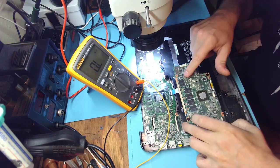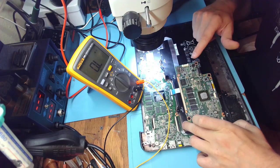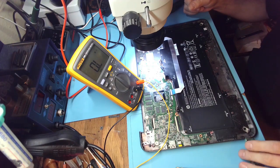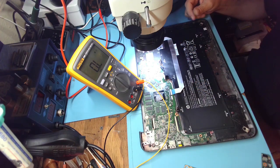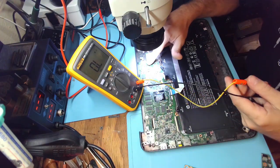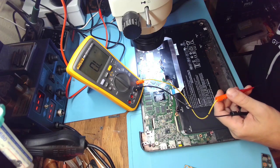Unfortunately I couldn't use this one because it's for a P-channel MOSFET and here we're using an N-channel MOSFET. But I ordered one from Mouser — it's like four bucks — and I was getting ready to resolder it, but then I figured I never checked those two MOSFETs in resistance mode.